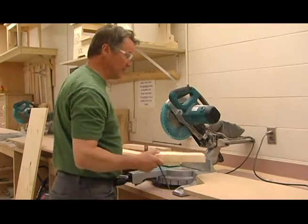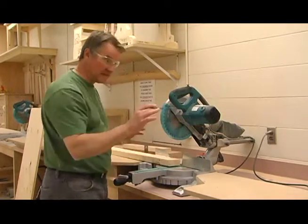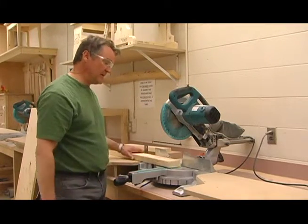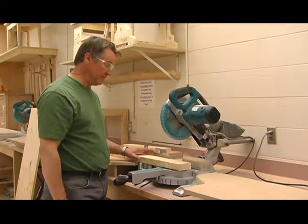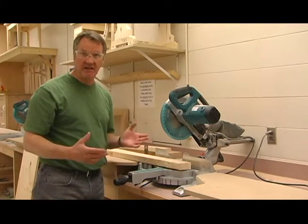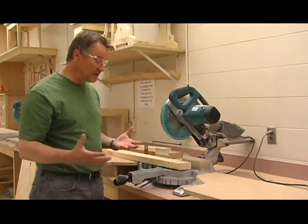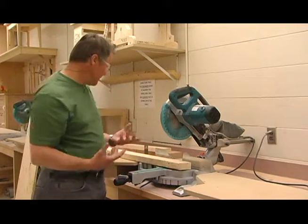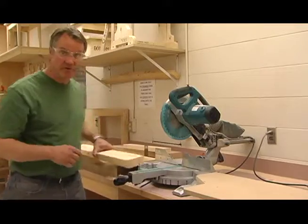Then get rid of the piece that you don't want. In that case, that's shorter than 1 foot, so we throw it out. Okay, and then there is our piece that we're looking for. So that's basically a 90 degree cut on a rough piece of material that has not been milled. Little different story when you're going to a milled piece.